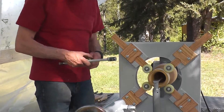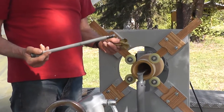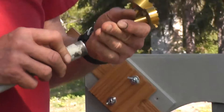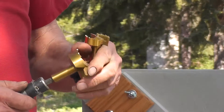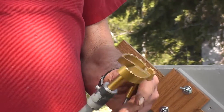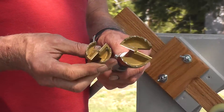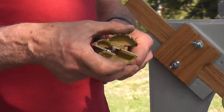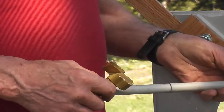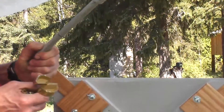In order to start the center I had to make an extension for my Forstner bits — just a piece of metal rod I'd found somewhere that had threads on both ends. I cut the threads, made a little collar so I could use an allen set screw to tighten it up. I started with the larger bit, went in about a half inch — that gave a nice center — then drilled it out with a smaller one. Since it was started with the larger bit as a guide on the outside, I could continue drilling all the way to the bottom.